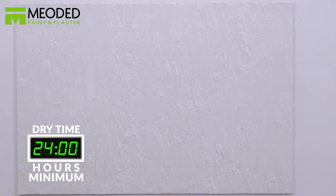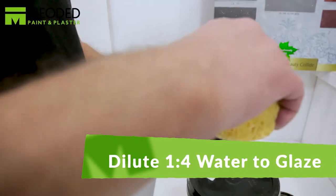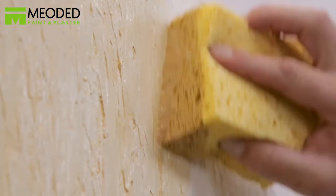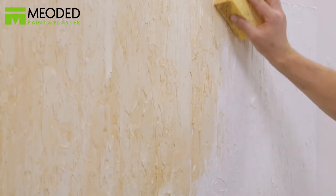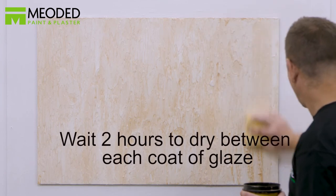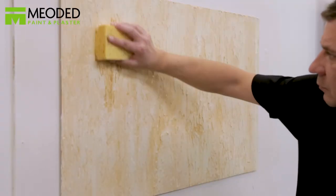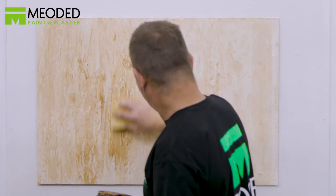Allow the surface to dry for a minimum of one day. Now apply the velator glaze — dilute it four-parts water to one-part glaze. Choose any color combination you desire to layer and age the wood texture. Here we are using a nice creamy color first. With a damp sponge, apply the glaze in a circular motion evenly. It's important to start light because it's easier to go from light to dark. Now go back with a sponge and add another coat, diluting it less to make the color darker, and go over some of the surface to add depth. For authenticity's sake, darken only parts of the layer.